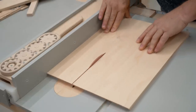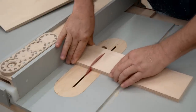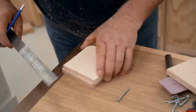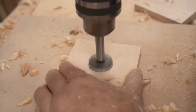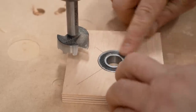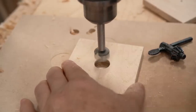I also need hubs for the wheels and once again that'll be half inch plywood. Next I can mark the center on those hubs and drill them out for either the bearings or the five-eighths inch shaft. I mark the center on the wheel blanks and drill those out with a five-eighths inch bit as well, and the reason why I'm drilling to that hole size is to make everything easier to line up.